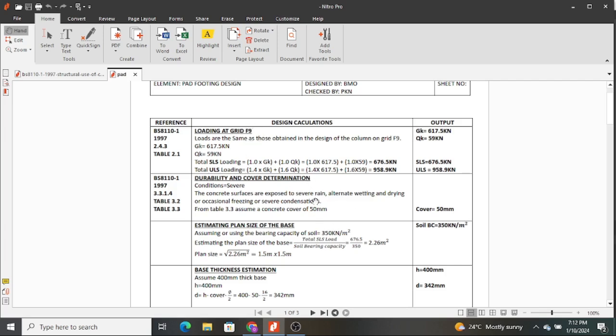I don't have the drawing here, but I hope you have understood what the F9 means. It's where axis F and axis 9 are intersecting, and a column at that place is the footing we are designing for. Actually, it is advisable that you design the column first. You get the reinforcement of the column, so that if the column is too slender or you have to make any changes, you design the footing when you already know the column dimensions. In this case, we designed the column, which I will present in the next video. The column design was 300 by 200 millimeters.